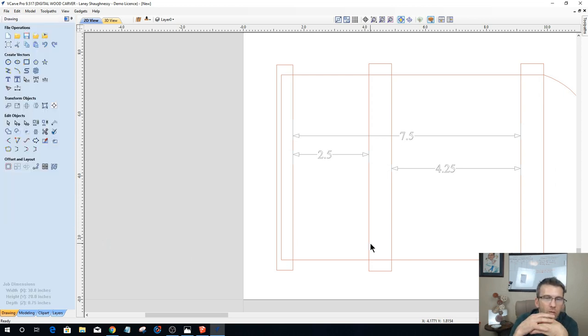Now at this point I could say, do I want to use a 1/2 inch piece of material, or a thinner shelf? No, I don't. I want to keep everything 3/4, so I don't have to carve my shelves on different pieces of wood. But so now I've got to decide. If I did 4 of my bowls at 1 1/8 inch, that's going to be 4 1/2 inches of space that I would need, plus a little bit of clearance for an air gap. I don't want to jam them in there, scratching up and jamming. So if I move this over another 1/4 inch, that's just barely going to give me 4 bowls stacked on top of each other. But if I move over 3/8, then that'll give me an extra 1/8 inch of air, which is fine.